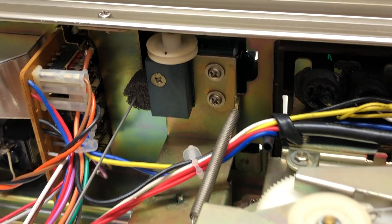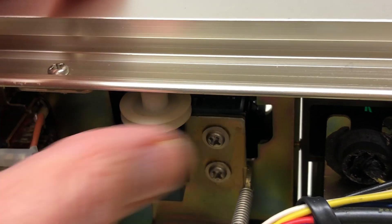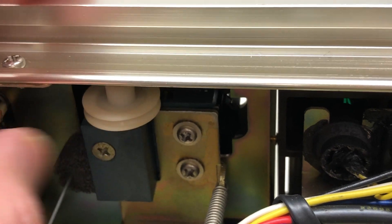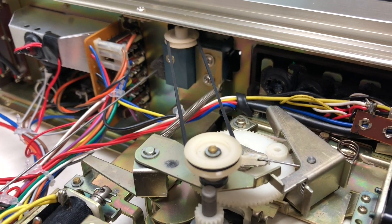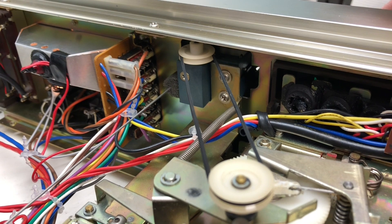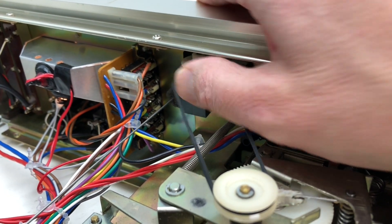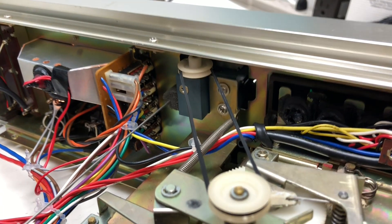So this may not be as simple as I thought. I assumed it was just the belt slipping on the pulley. I tried a couple different belts — they didn't work — and then I started turning this. At first it turns easy. I put a black mark there, but here you can see it doesn't want to move anymore. I can go backwards and mess with it a bit, and then it typically stops again. A little more proof that it's not the belt — something about this thing getting stuck. The pulley will go around eleven and a half times and then consistently get stuck.